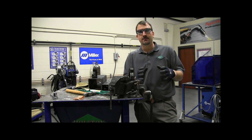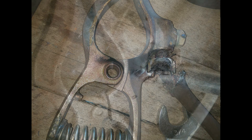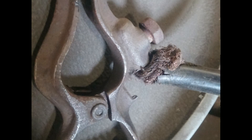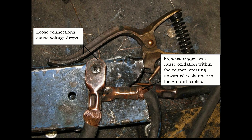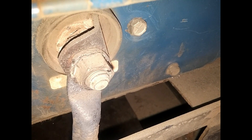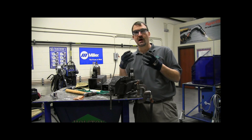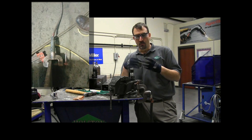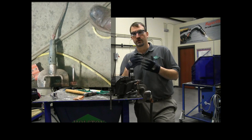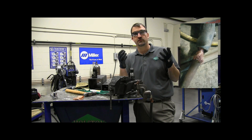Now let's talk about cable maintenance and what to look for when a cable needs to be replaced. Here are some pictures of cables and connections found in different facilities over the years. What you'll find in common is exposed copper — anytime copper is exposed to the atmosphere it begins to oxidize, and oxidized copper has a higher resistance than clean shiny copper, resulting in greater voltage drop. You'll also find connections with missing or broken strands at the termination from being dragged around and neglected. When you lose copper strands you don't have the same cross-sectional area for current to transfer through.